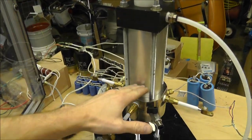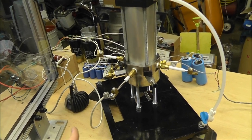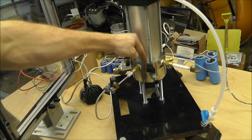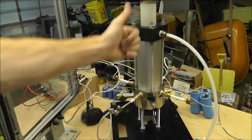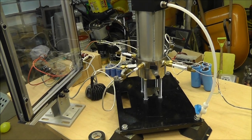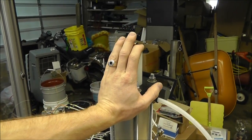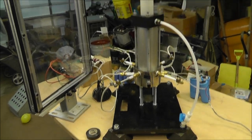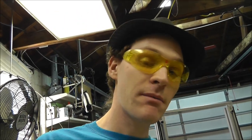But also, originally in my hydrogen videos, you see that the whole device actually lifts off the table. That's because when this piston goes up and stops, there's a negative pressure here which wants to pull that piston down, and the rest of this unit wants to go somewhere. And now that I have this equal pressure on the top side, it wants to do that even more. So this thing lifts off the table even further. In theory, and this might be wrong, this piston moving up and slowing down is actually lifting the rest of this unit off the table. So in theory, you could calculate how much this weighs, and actually it's like 70 pounds, 70 plus.